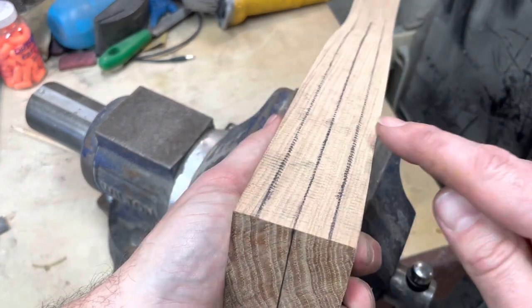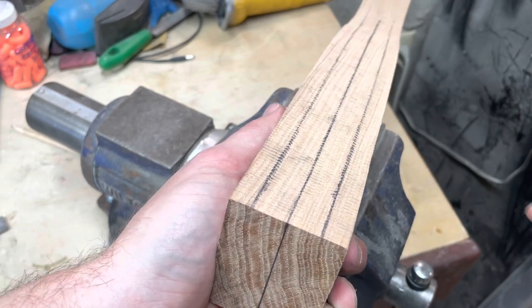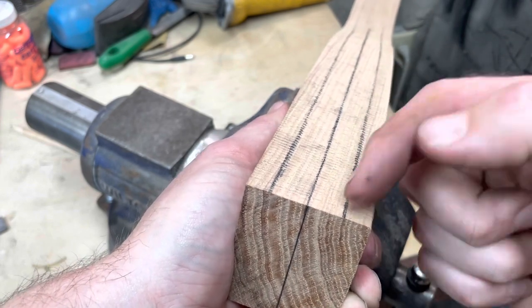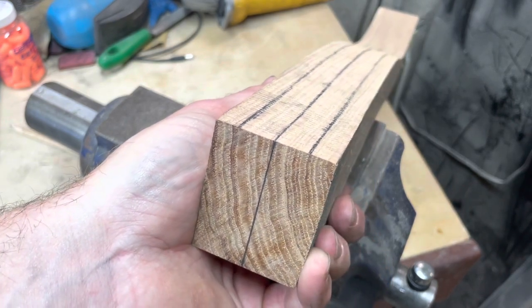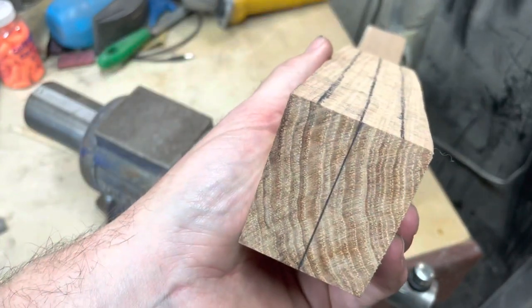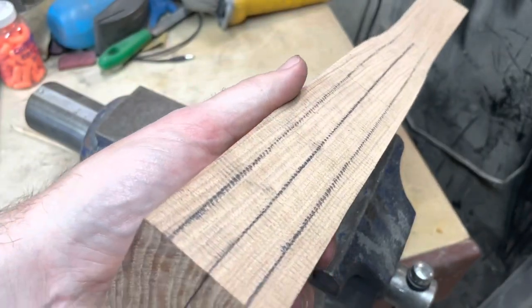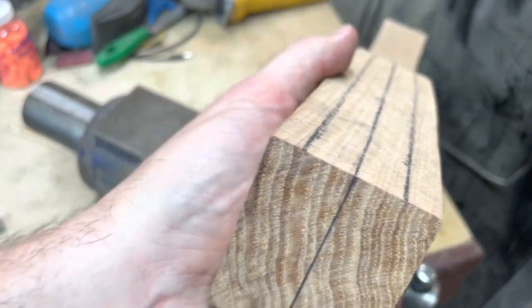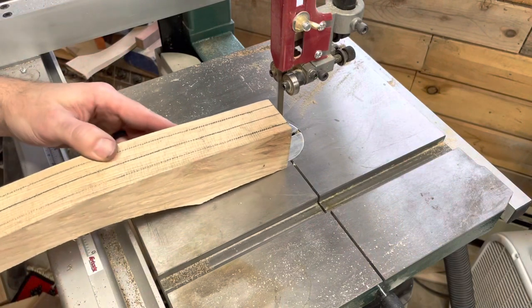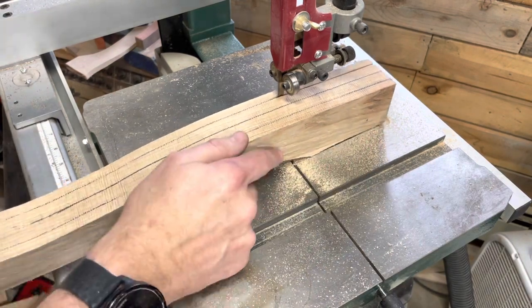I'll be cutting right along these lines on the outside, so I'll just have a thinned-down blank. Once you trace your eye and have your width, a lot of times I'll use the bandsaw again to remove even more material. You can see this isn't perfect — the bandsaw cut is actually pretty good, but it's not 100% square. That's why you have a little wiggle room, and as you shape and adjust things you'll be able to address that. If we'd already measured the eye and traced it out, we might have run a tighter line, but we just wanted to do the most simple blank.